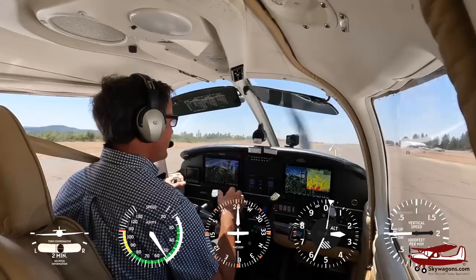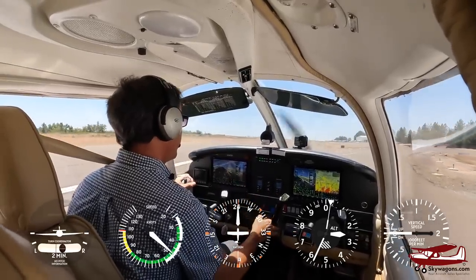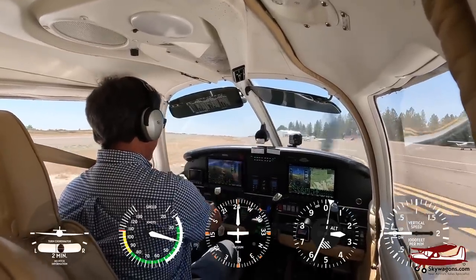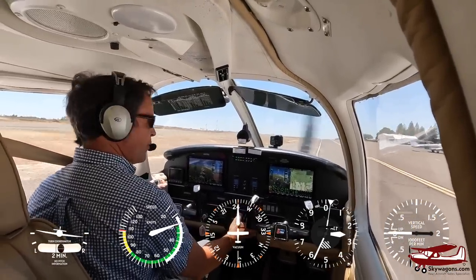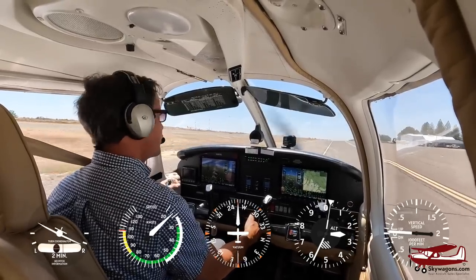So I barely used the turbo. I took off a little bit of turbo, but I didn't use it all the way downwind, base, final, so there's no idling and cooling on the ground because it's already been at a massively reduced power setting. So we can just shut her off. But there it is in the pattern, a very, very nice 77 Turbo Arrow 3 with the Continental and the wastegate and the intercooler.